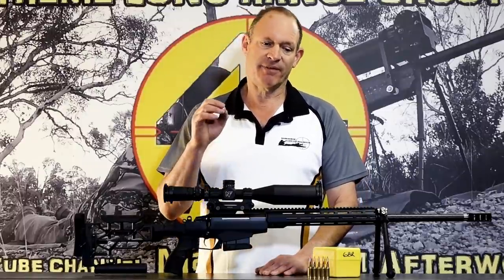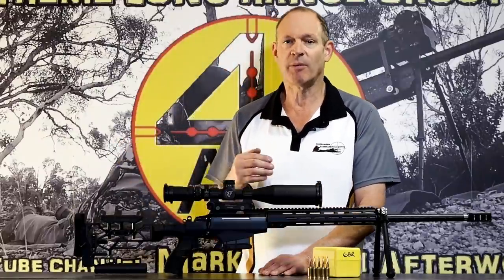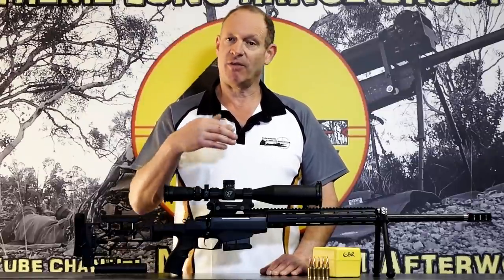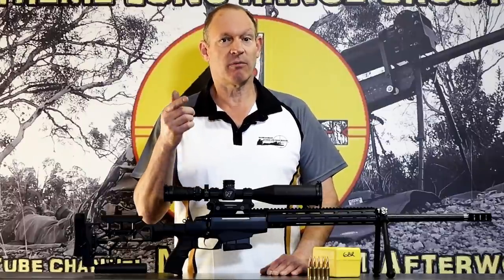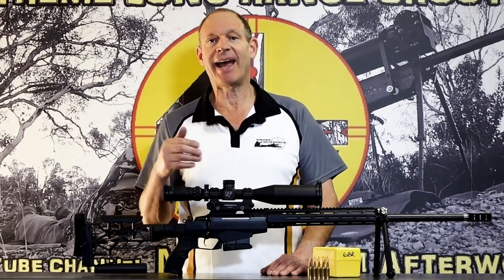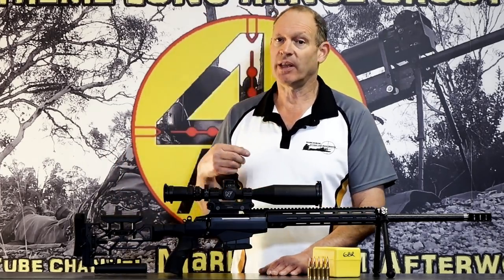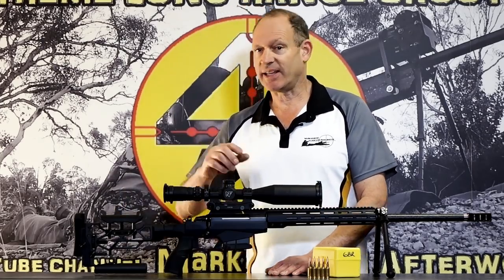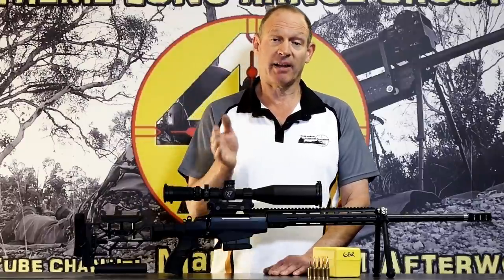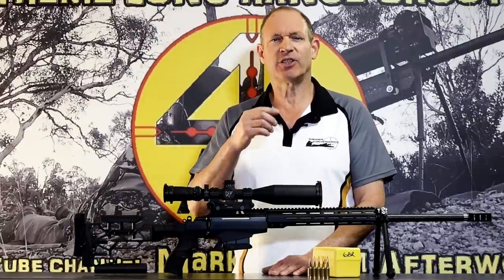If you have burst primers, blown primers, for whatever reason you have them, you probably can fix it with the simple case of changing pressure, but it's not likely to be the problem unless you've got other signs. It's probably compounding a different problem and showing up with something. Whether that's the firing pin protrusion, the clearance to the bolt face, or a weak firing pin spring, it's showing up the problem, and maybe backing off the pressure will help, but it isn't really the problem.